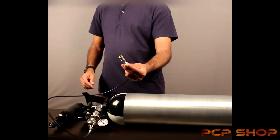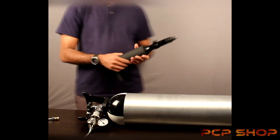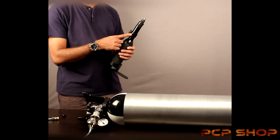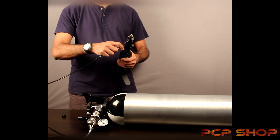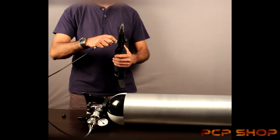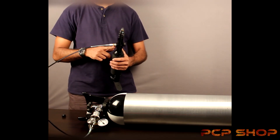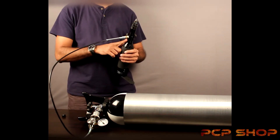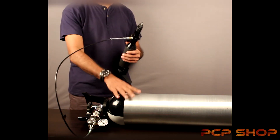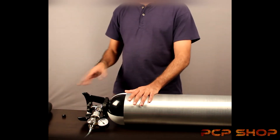We're going to show you how to attach the female foster onto the male foster on the gun. Most air guns come with male foster fittings. You just got to shunt it, pull the steel knurling back, and you're going to see the female foster move on ahead. Once it seats in place, just release the knurl cap — that locks it in place. Check and make sure the female foster is coupled to the male foster. This is very important — we're dealing with high pressure here, and safety is of paramount importance.